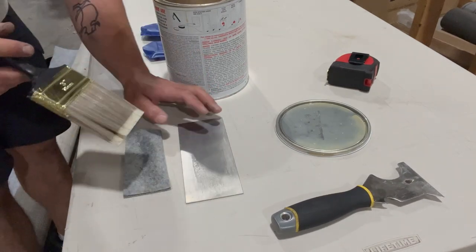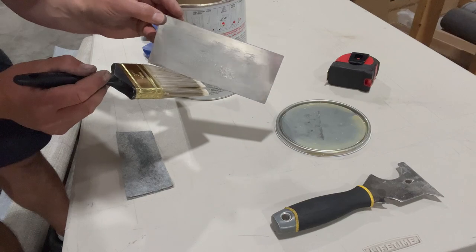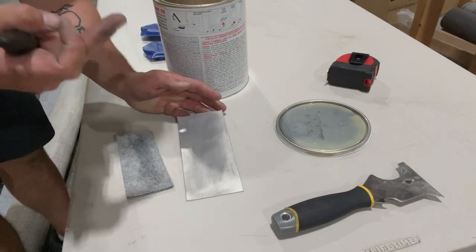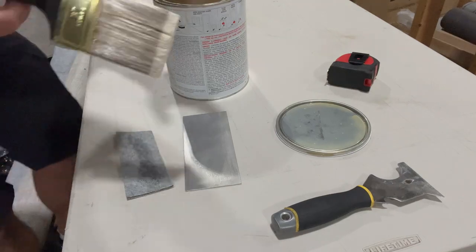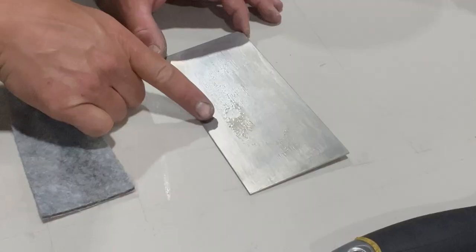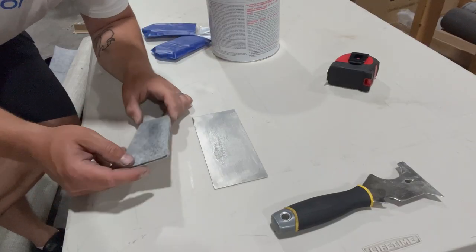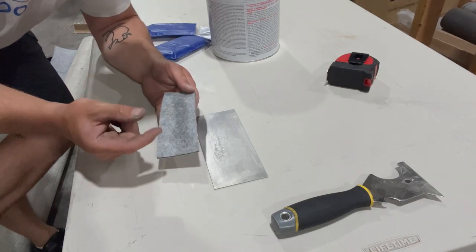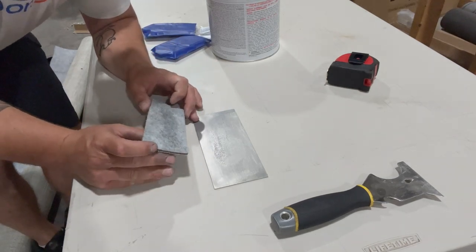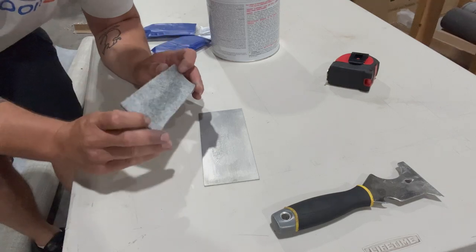I'm going to look at my piece of aluminum - you can kind of see where that adhesive is. You can see where it's sparkling there, sheeny - that's a little bit thicker. If I touch that right now, it comes off and barely even sticks to my fingers; it's mostly just wet. If it's wet, that's going to be too wet. You can see right here where it's kind of slick looking - I can smooth that out with my finger and that's going to get rid of that solvent and allow things to stick together. I'm going to feel my vinyl - there's a little bit of tack there. If I touch both and nothing feels wet, maybe a little tacky but not wet, that's the key. It can't be wet.